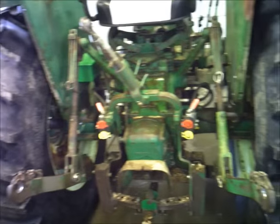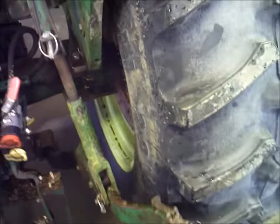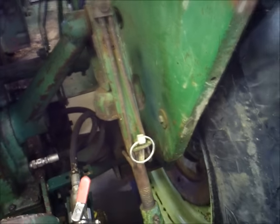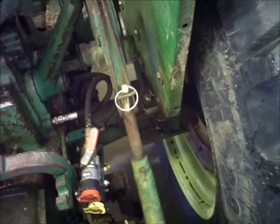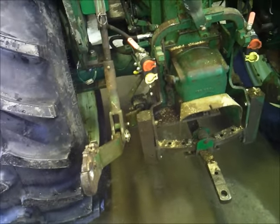They got the new tires on this thing. There's one little thing I do have to take care of now that arose when I narrowed it up — the three-point hitch arms like to swing out into the tire. The way the original stops work, they got this spring-loaded piece of rod that's bent around, and that's supposed to be your anti-sway. Well, those springs aren't strong enough to keep them from doing this. When I was driving it down to the barn last night, this one was doing it worse — it would smack the tire and then just kept bouncing off. So what I'm gonna do is make it like they went to on the 55 series.